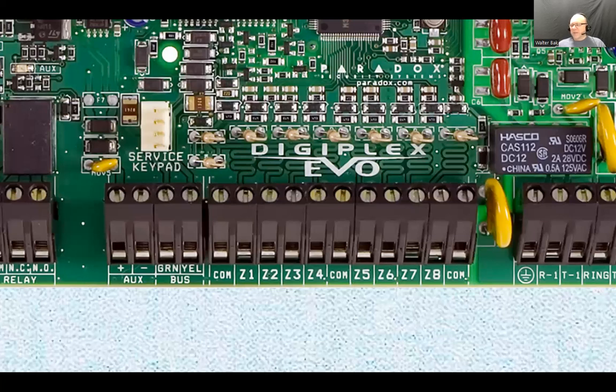So look what happens. The motion sensor is programmed to be normally closed. That means if nothing happens, the contact is closed, providing a closed loop from the common terminal to the zone. Instead of just a wire, you have the sensor device. If the motion sensor senses motion, it opens the contact, and that means the system is going to read open on zone 1. Now it depends whether the alarm system is armed or not. If it's armed, an alarm condition can be triggered. If it's not armed, maybe it's going to show you on the keypad that there's motion in the living room.